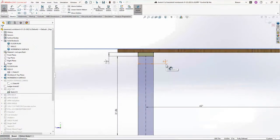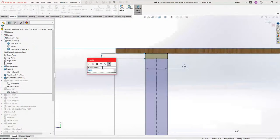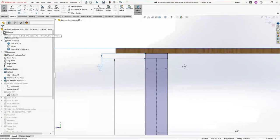And this is where you can really do some cool things to automate your workflow. So Jordan, in his workflow, was doing a ton of framing. So he provided some templates that have predefined global variables for things like thickness. So think about it. If we're using 2x4, 2x6, 2x8 dimensional lumber, I'm going to be using 1.5 inches a lot. So one of the things you could do is set up a variable called 2x thickness and actually create that as a variable. So it's got the little globe symbol next to it. Look at that. That's great. And not like that's going to change anytime soon, I don't think, but it is nice to set that and you're not going to fat finger that.